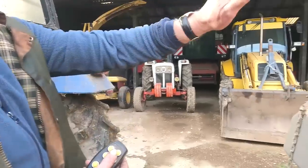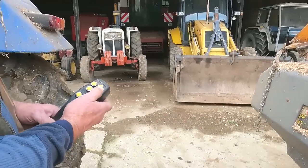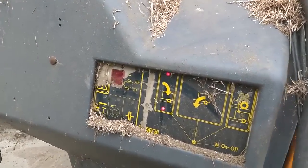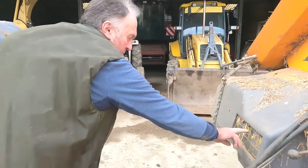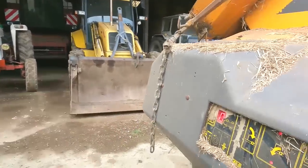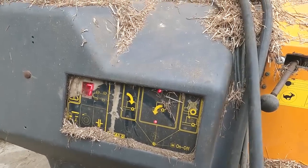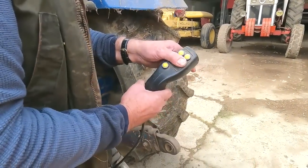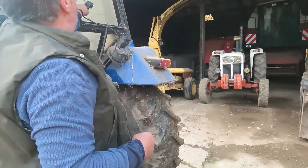That shoves back the silage or the hay or the straw from the rotor, and then that one will push it forward. There's 9 speeds forward. So that's when you're in load. So then when you want, you're back into feeding mode. See there? So then you can adjust all the gears, whatever speed you want to flow it. And then when you want the floor to work, you press the 2 buttons together, and then you play it like that. Works very well.